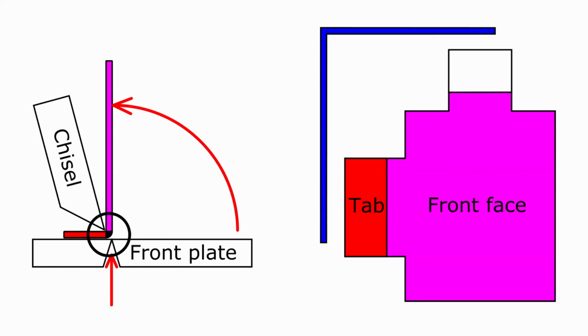Generally speaking, there will be more stretching on the outside of the bend than there will be compression on the inside. As a first approximation, you can assume that the interior dimensions will be preserved. This means that the bent metal will be slightly oversized by the thickness of the sheet.